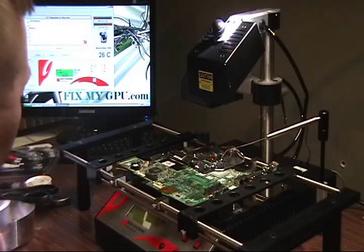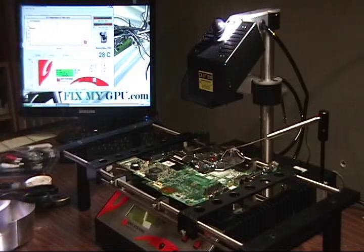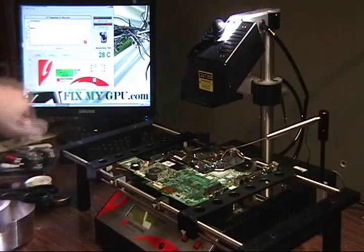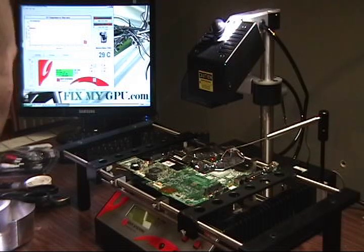Since the solder underneath the chip is still lead-free solder, I've seen people try to use the pickup tool on the machine at about 180 degrees Celsius, which I like to get a little bit hotter than that, considering the melting point of lead-free solder is around 220 degrees Celsius.